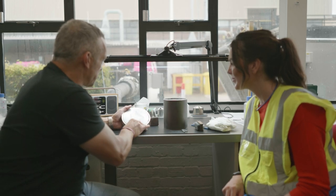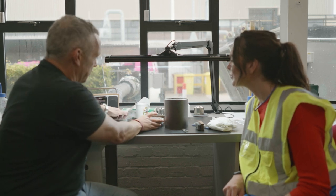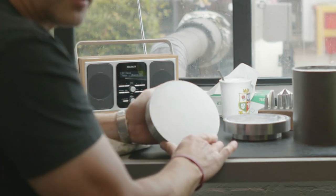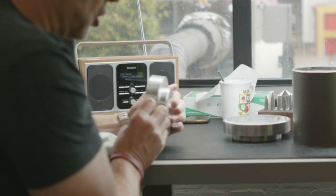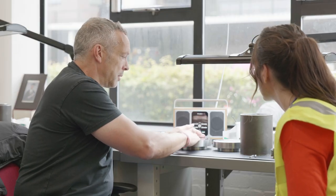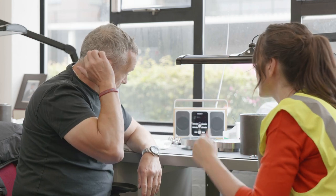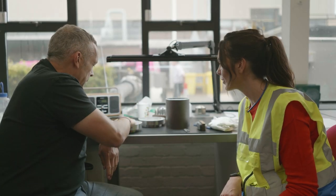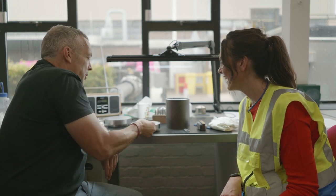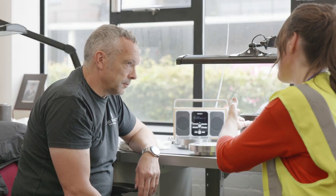Literally, what I'm doing on this particular die is we start off like the blank, and there you go, there's the blank. So we've got the same shape already turned, and then we'll transfer that, and we get that. And so that's done on that CNC? On the CNC machine. It's placed in the chuck, where you can see the coin, and then that cutter will do the same thing and produce this. But, so this setup here, it seems like you're doing a bit by hand as well.